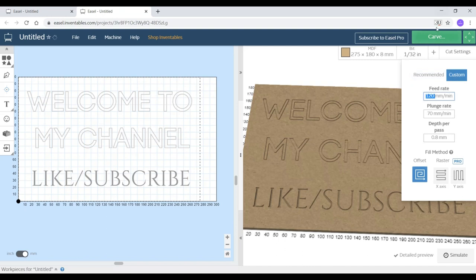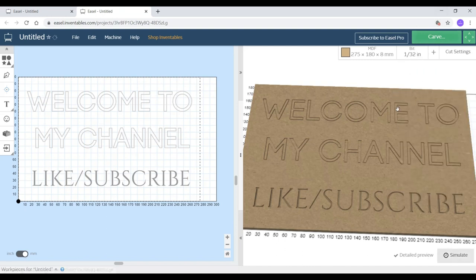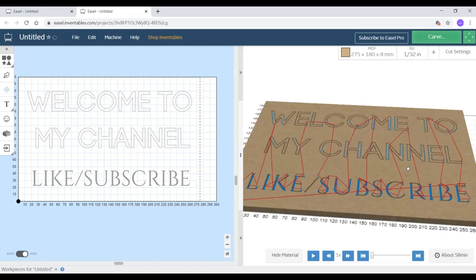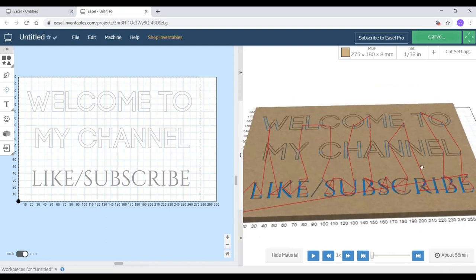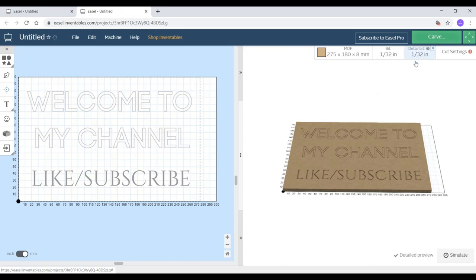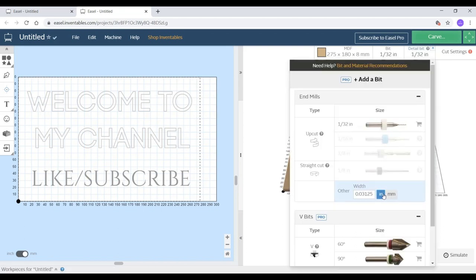Here I am keeping everything same, just changing my feed rate from 120 to 300 mm per minute. Now you can see the time shown to engrave is 58 minutes, which is approximately 2 hours faster than the previous feed rate. But make sure the feed rate depends upon which kind of bit you are using here.